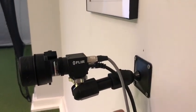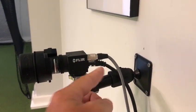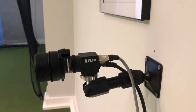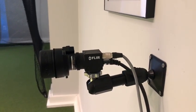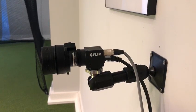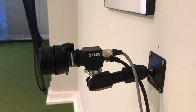The video feed goes through a Cat6 cable connected right into the back of the camera, and this camera is powered so you can have a power source. You also have the option to get this camera with Power over Ethernet, which would eliminate the power cord, because you can get both the power and the video feed right over the Cat6 cable.